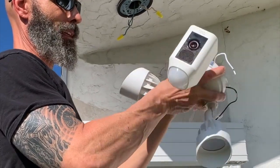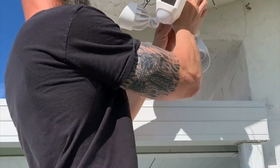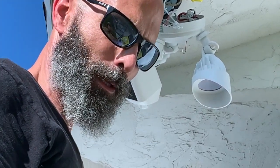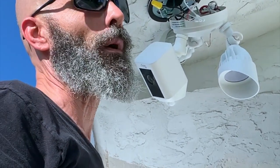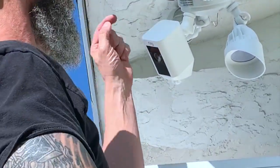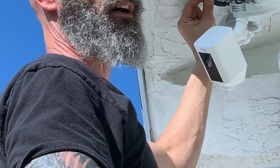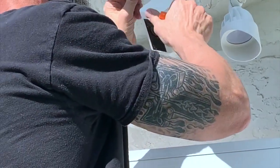I've already attached the plate to the house and I'm going to get ready to wire this and attach it to the plate. They provide just a little hook to hold it there while you are fully wired. I'll put it up there temporarily, sign into the Ring app to see if the camera is facing exactly where I want it, and then take the light back down and put silicone around the bracket for a tight seal — no water will get in. The foam they provide isn't as good of a seal against stucco, but silicone will fill in all the gaps.